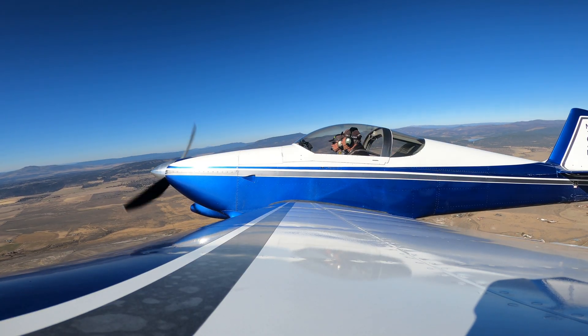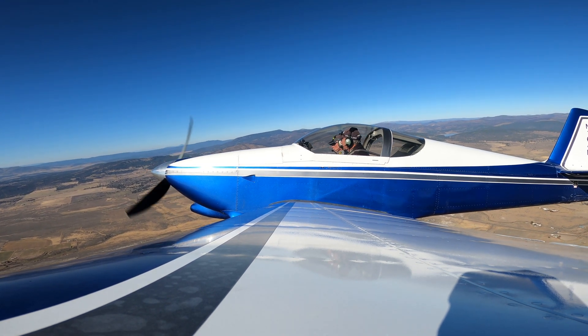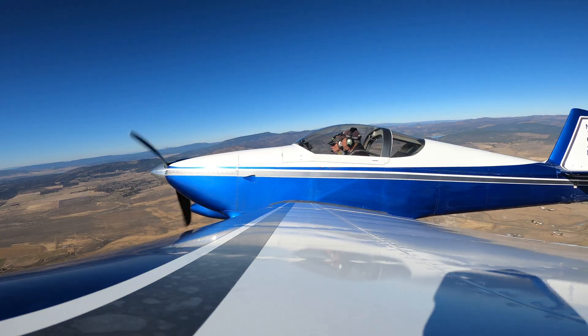We're actually going to be doing a stall, so we want about 3,000 feet AGL, and we want smooth air for this, because if you get a lot of rough turbulence, that's going to mess up the angle of attack and give you a less precise calibration. So ideally you'll do this first thing in the morning — make sure you've got nice smooth air, you're cool, you're fresh, you're relaxed.